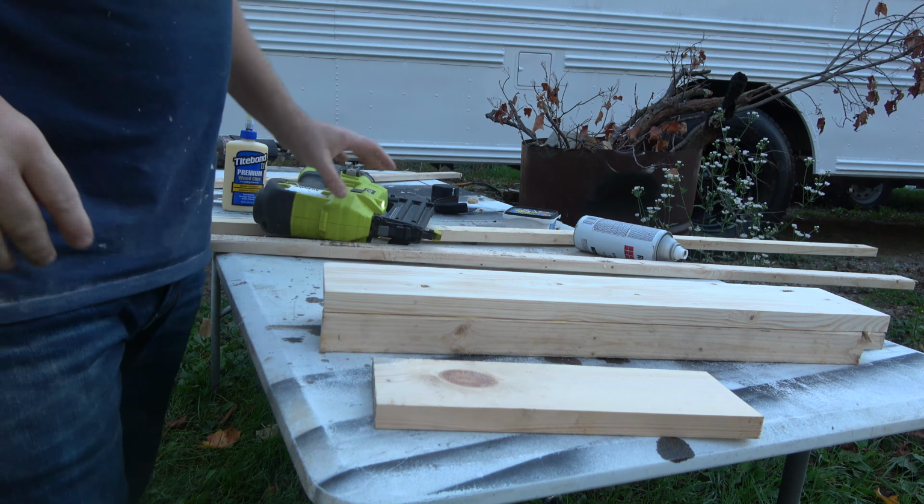Installation. The bulk of this unit is held in place with a single self-drilling screw. Many people incorrectly call this a self-tapping screw, but all screws by definition are self-tapping. Only certain screws are self-drilling. In this footage, the holes are pre-drilled because I just took what was already built apart so I could make this how-to video. It normally takes a bit more effort to get the screw to drill through the steel.